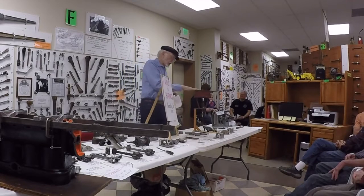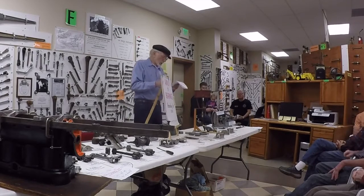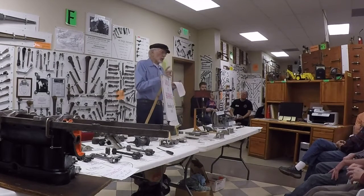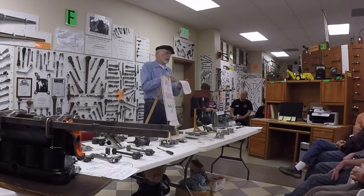A ladle of babbit that is at pouring temperature will glow red in a blacked out room. You can barely see it, but it'll be red. If you've got any light at all, you can't see it. For example, ASTM-2, that's what I'm using, that's a tin base. It melts at 460, but you pour it at 875. So just the fact that it got melted and you kind of spill it around in there, it's not hot enough.